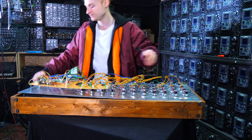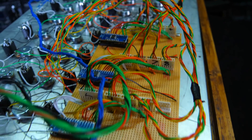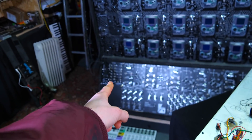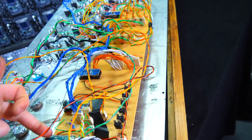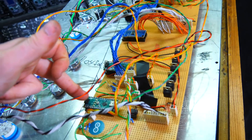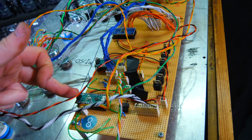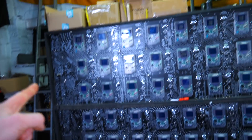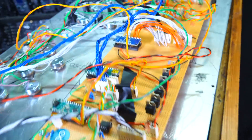On the back you'll see this stripboard, which has basically got an Arduino. This Arduino has code from when I built it into the Game Boy Mega Machine, which splits the polyphonic signals off to separate channels. This makes it polyphonic from MIDI channel one to five across the different voices, the same as the Mega Machine.